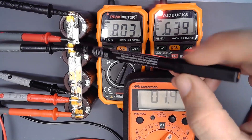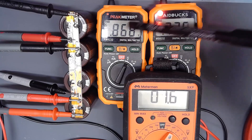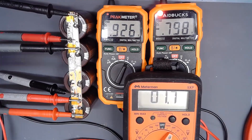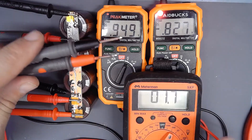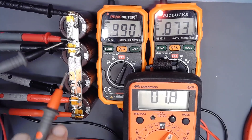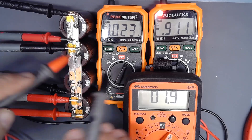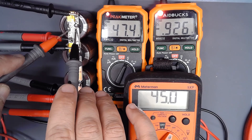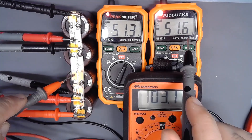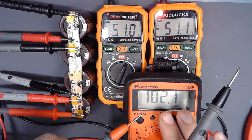This is the principle of working. Here, for instance, a multimeter is connected on the first rail and another for the negative rail, and this one shows the total voltage of this filter. I have this probe with about 50 volts on it — not real high voltage. I'm going to charge each bank of capacitors one after the other to see how it reacts on the multimeter. I charge the first and have 50 volts on the first multimeter, then the second showing the negative rail voltage, and here we have the total of all capacitors — this is the extreme limit of the rail.